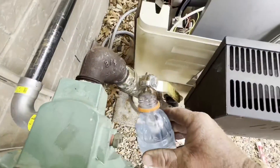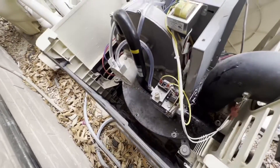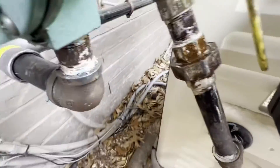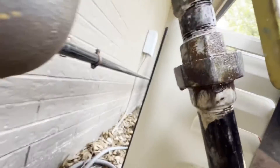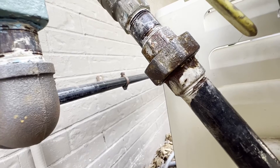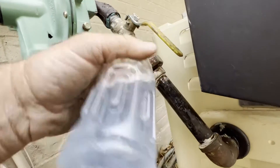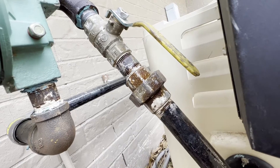That's the green thing you see there in the picture right there. This is me just testing the pipes, making sure we don't have any leaks. This is just really good soapy water — I like Dawn dishwashing detergent, it bubbles up the best. Great stuff. Now you can see a little bubble right there, so we'll tighten that up, and then test it again to make sure there's no problems. Still see one more little bubble there to the right. So just tighten and test until you get it to where there's no bubbles, no leaks, and you'll know you've got it sealed up properly.